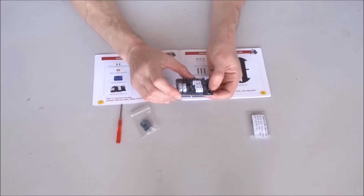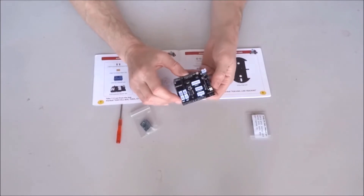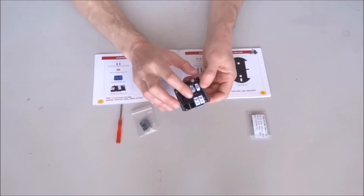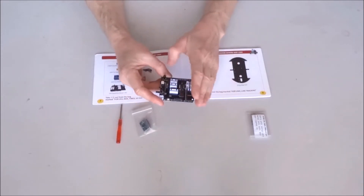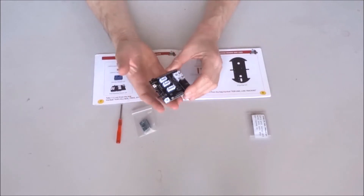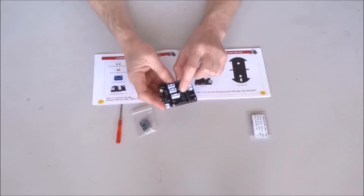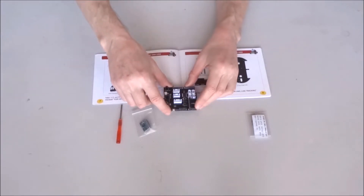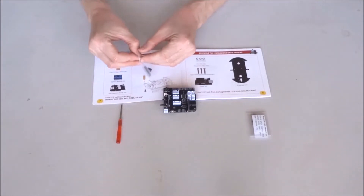We will have to see about the UART connection. We have two connectors for servos. We will use only one servo, but we can always add a second or potentially some other sensor. Although this shield does not have many options for further expansion, you can always add another shield underneath it or use the spare servo connector to add your own sensor. So it is not as if the shield is completely non-expandable.